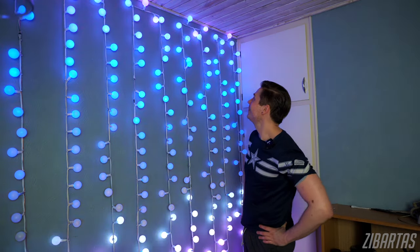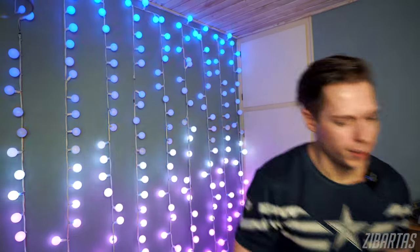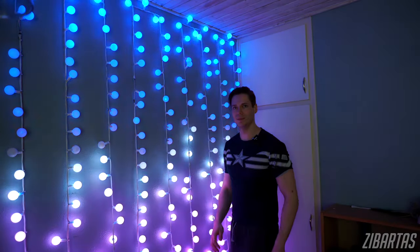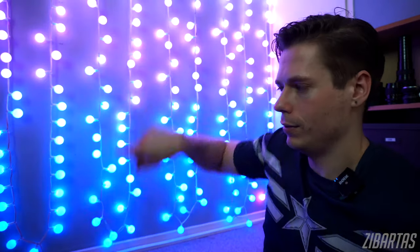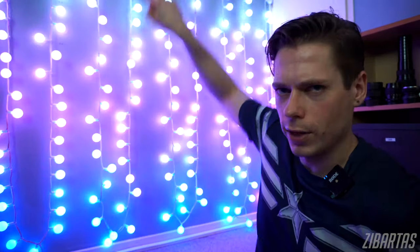It took a little while, but how cool is this? I think I'll turn off the video light just to show how bright it is. Ooh, it's nice and intimate. So, to make this and many other cool animations possible, I subdivided the entire array of LEDs into individual segments. That's why, even though the LEDs are hooked up in a zigzag, you can see them pulsing all evenly from the bottom to the top, even though some of them are running downwards logically.